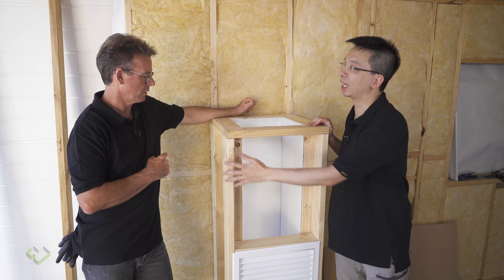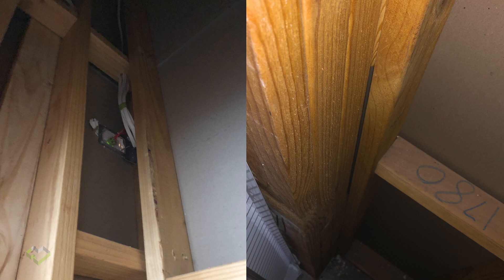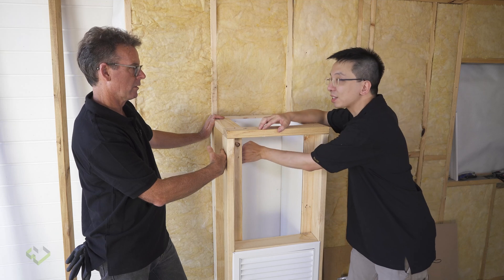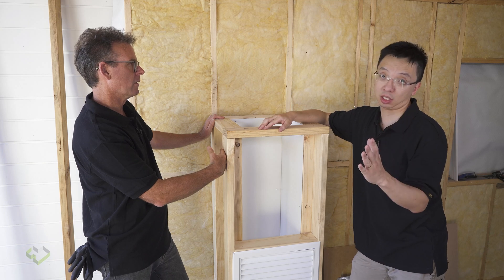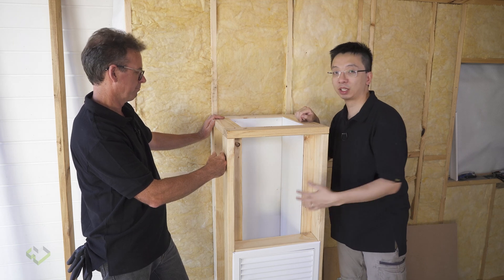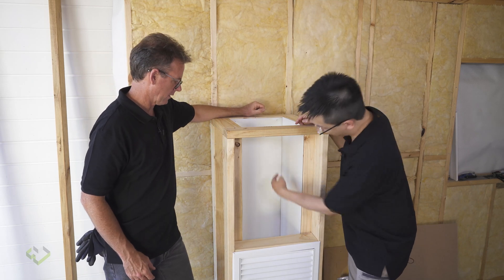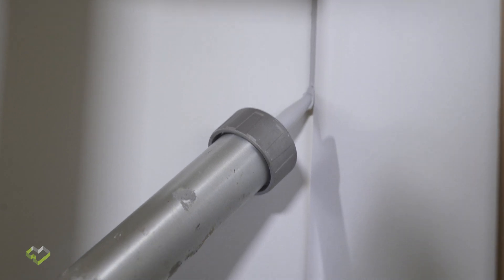The sides are usually encapsulated with interior plasterboard, and of course we can air seal that by masticing the junction from the inside to the plasterboard. But lining the interior will cut your work by more than half, because when you look into it, if you line the interior all you have to seal is just one junction along the two back corners.